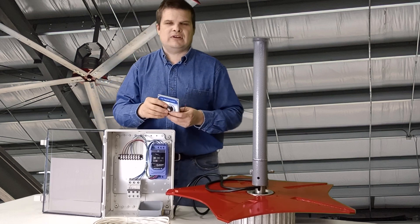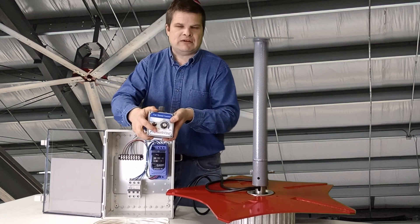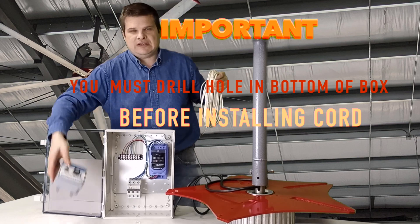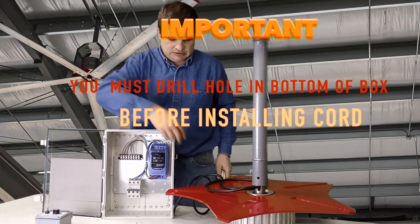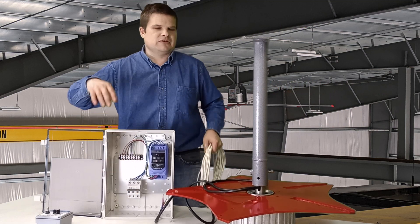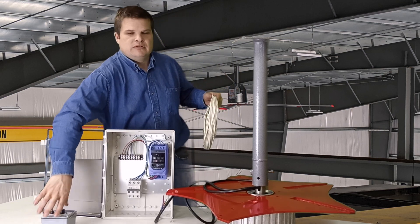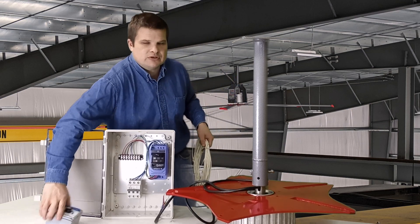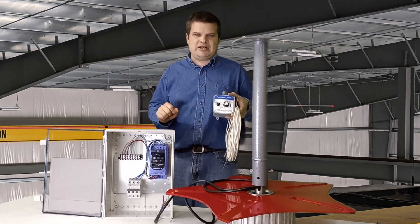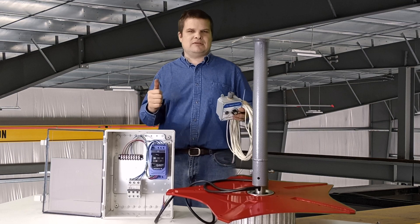That's how you wire the Amerowind E-Series fans. The VSDM1 mounts down at your doorway, wherever it's convenient to turn it on and off. Your control wire goes between the VSDM1 and the variable speed drive. Power from the motor comes in the bottom of the VSD, and power from your breaker panel comes in here. If you don't want manual controls, we have automatic ones that speed the fans up and down with temperature — your heaters turn on, your fans start, and mix the air just right. Thanks for watching; if you have any questions, give us a call.